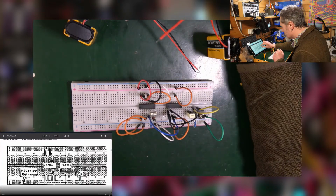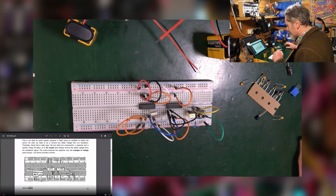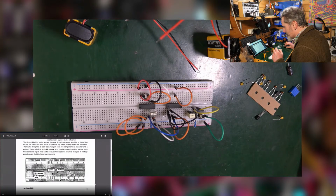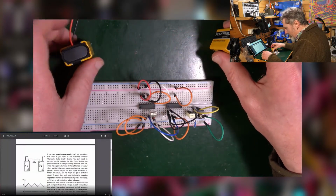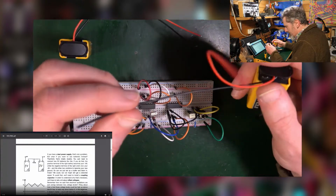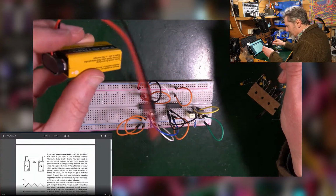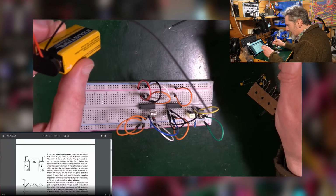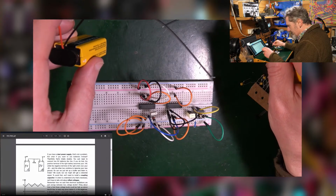Right, let's go back up to the diagram on the battery. So we've got two batteries, and I know that I'm going to connect the negative of one to -9. The negative one goes somewhere. The positive goes to the same place as the negative of the other one, and then the positive goes somewhere. So I'm ending up creating 3 rails. That's the point, I think.